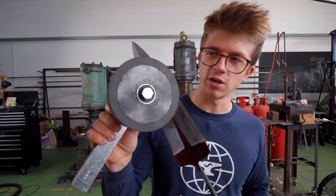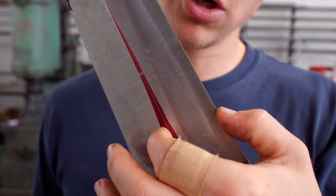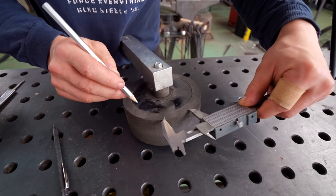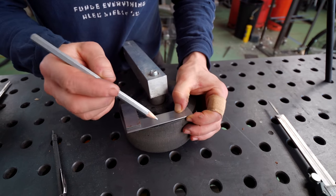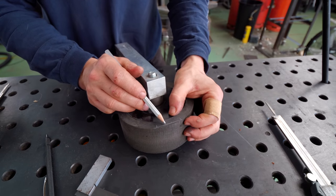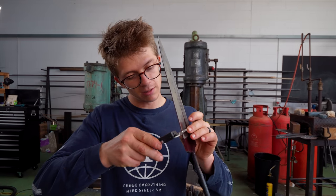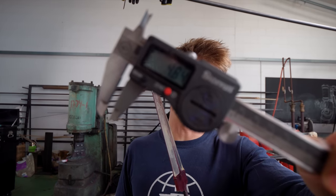So I've started off with this 5-inch contact wheel, 5-inch diameter. And the line that it's making is not very wide. What I could have and should have done is measured this right here, that width. And I should have calculated, or even as simply drawn, onto something of the 5-inch diameter to then find out how deep the radius of this wheel is going to poke into the steel to be able to get the full width fuller. Well, quite deep. This fuller looks like it would punch in about 3 millimeters from either side, and we've got to know, can we accept that? I don't think we can, because the center of my bevel is 4.8 millimeters thick.